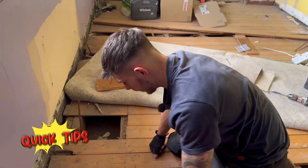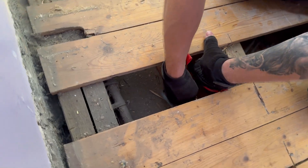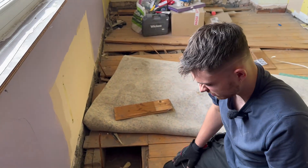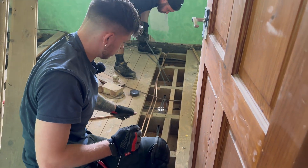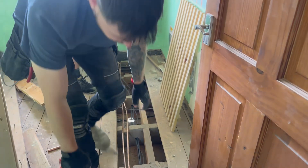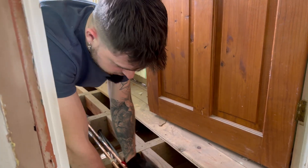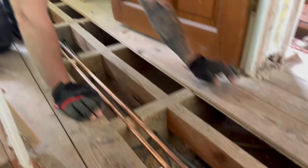It's always good practice when going into the holes - what we're doing is bending the cables so as they come around it stops the cable being squished against the joist and they can all come in straight. It looks a lot better and tidier. As I was talking about in the last episode, pull the cables gently - you don't want to be yanking them through because you'll rip all the sheathing off the cables. So we're just taking our time, taking it through each hole, feeding it - not yanking it, not damaging any of the cable.